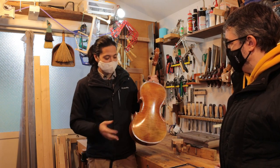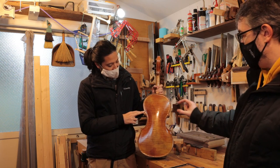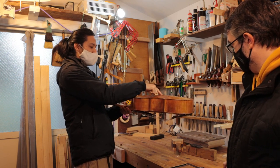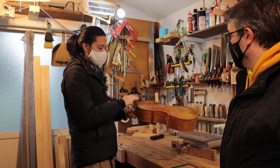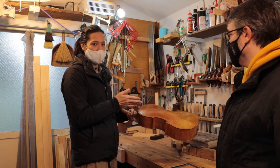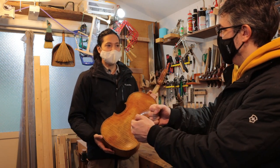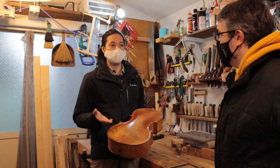These boards were about one to one-and-a-half inches thick — about 30 to 35 millimeters — at the beginning. So you started with boards that thick, butt jointed them, and then carved them down. You can't really plan completely ahead where the joint will end up in the final surface, so everything has to be perfect. If those edges aren't completely straight, you might get a gap revealed as you plane down, or it could just be a weak spot.